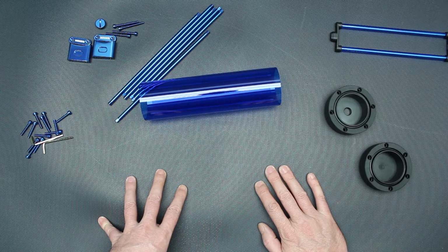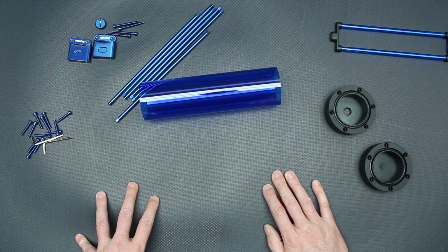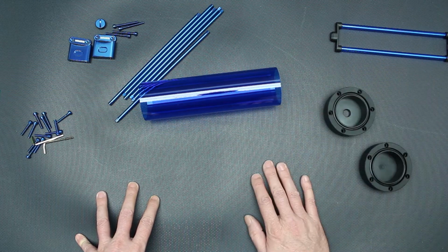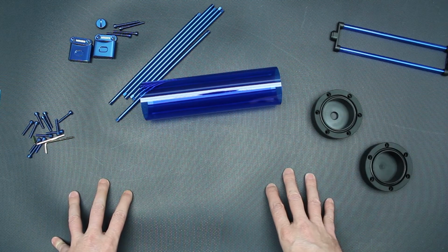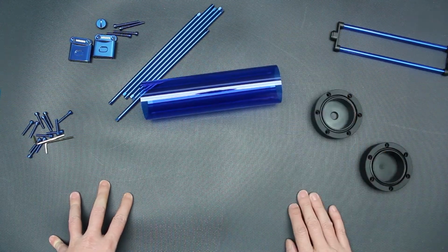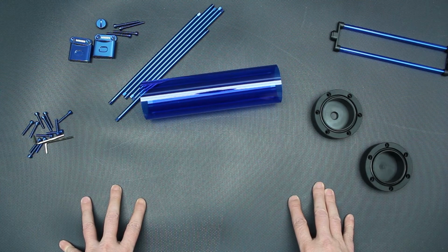If you keep tightening and keep tightening, the chances are you're just going to strip out screws. Obviously the very best thing to do is to make sure everything's clean before you put it together, but if you do find a situation where you've got a very slow leak, it's almost always going to be some kind of debris in the O-ring or where it mates up against. In very, very odd cases, you may have damaged the O-ring and got a crease in it or something. So make sure you're assembling anything with O-rings on a clean surface and you've inspected them. Barring that, if you find that you do have a slow leak, you're just going to have to take it apart and clean out those O-rings, clean out the O-ring seal, inspect the O-rings for any kind of damage, and reassemble the unit. Again, much better to just do it right the first time.